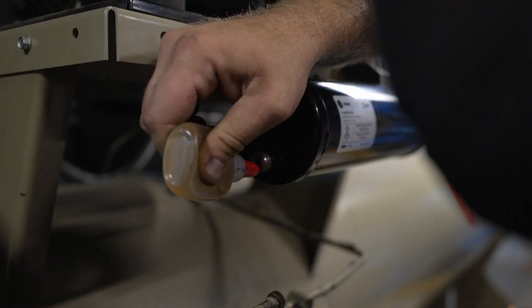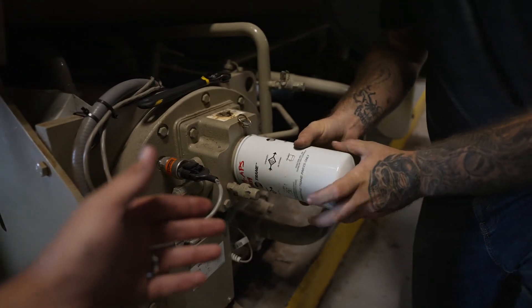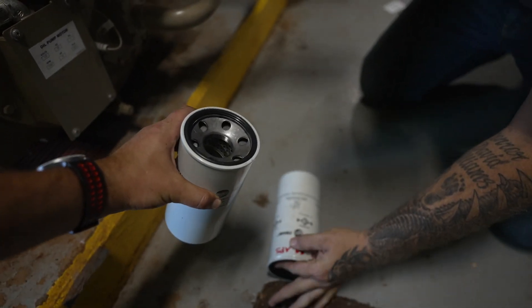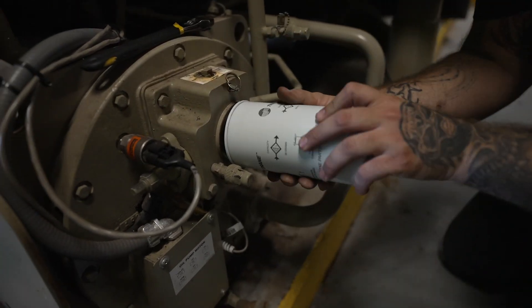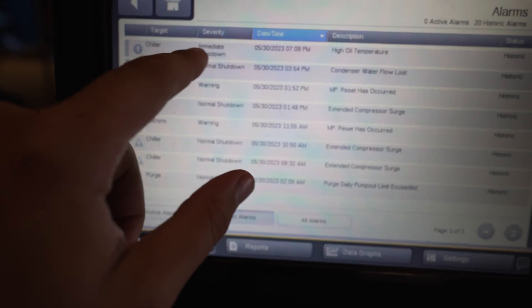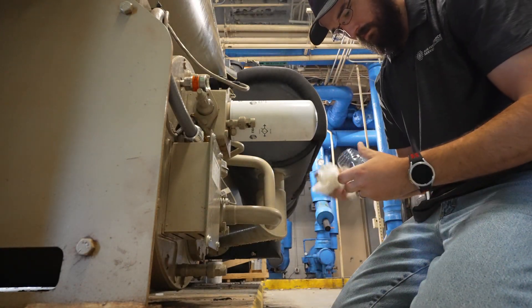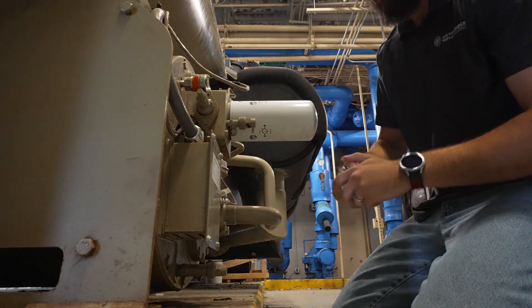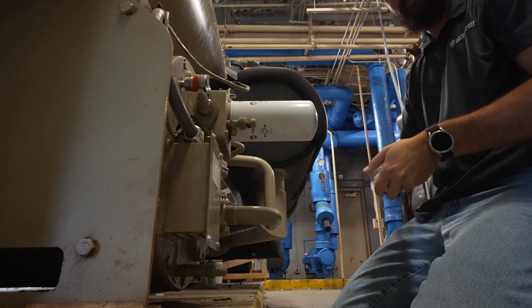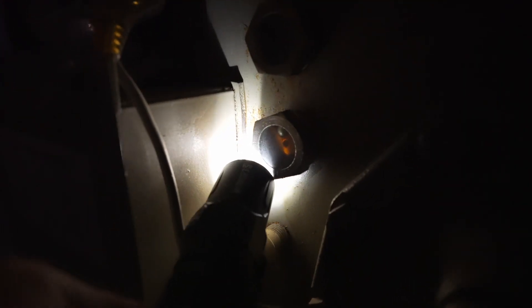With the system charged and the purge filter and oil filter changed — separate videos on those — the CVHF centrifugal chiller was finally ready for startup. We left the purge unit running overnight to clean up what it could, since the system had a very significant prior leak and we knew it would have a heavy atmospheric load. The startup process became its own involved situation so I'm making that a separate video. Let me know if you enjoyed this format and if you'd like more content like this. Take care of yourself, take care of your family, spend time with your spouse, and stay safe out there.